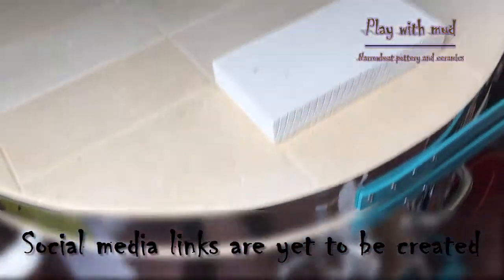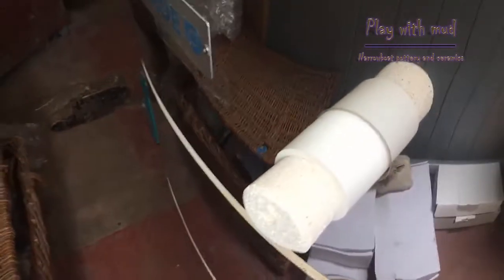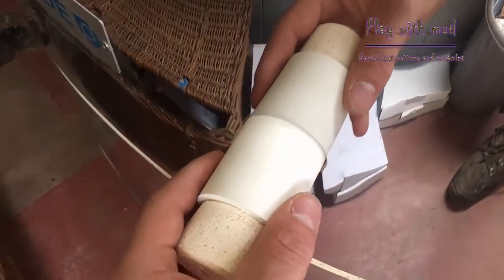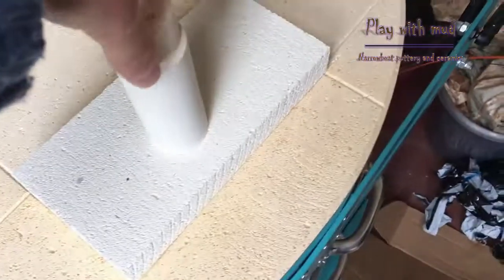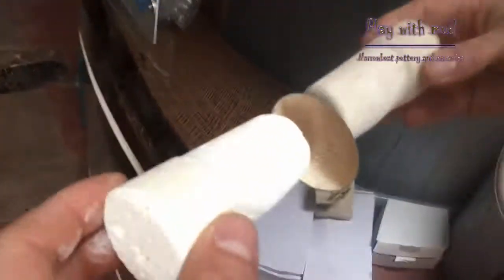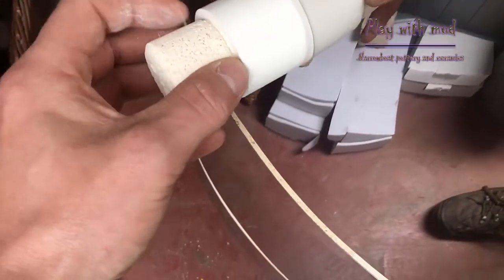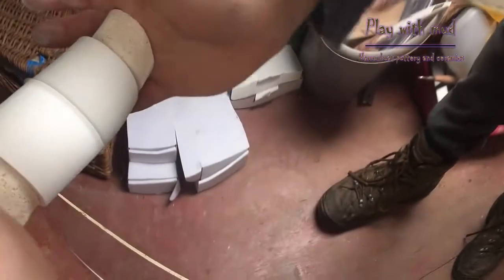Finally the kiln has been unpackaged — it's looking nice and shiny. For those of you lucky enough to own one of these, you'll get two spare pieces that come with the rod of kiln. If you just take one on its own and try to put it in there, you'll notice it won't fit. What you have to do — as well as not losing your fingers — is to put that first piece in, which extends the place where you'll position the thermocouple further away, and that completely seals the hole. When you take it out to have a peek, it's at a considerable distance from the really hot part.